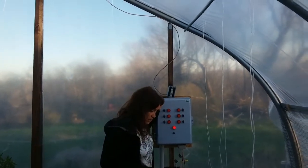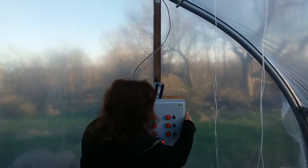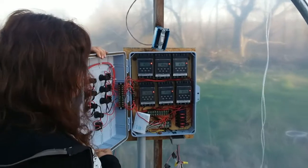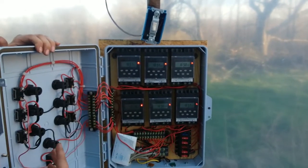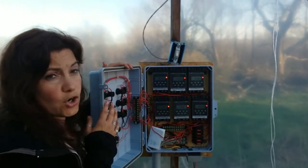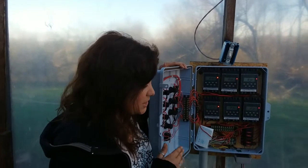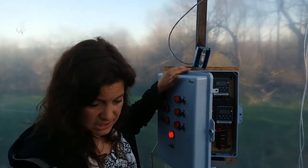This is the control panel for our system. Each of these switches controls one of the six rows. Inside the panel are the timers — each one runs one of the rows and can be set individually. They run a few minutes each hour to make sure nutrient is constantly being delivered to the plants. This system is completely off-grid: we have four 100-watt solar panels powering it, hooked to batteries so that even on cloudy days the timers still run and there's plenty of power. Those timers power a small pump contained in each tank, which delivers the nutrient to the plants in each row.